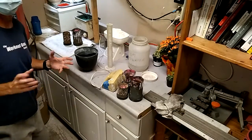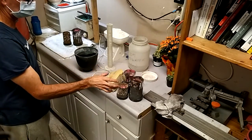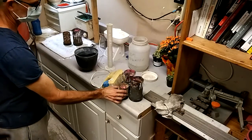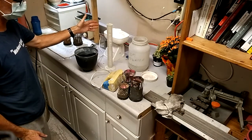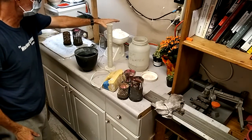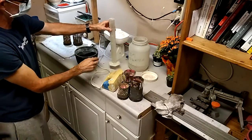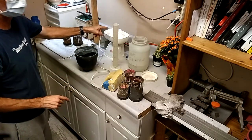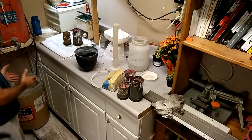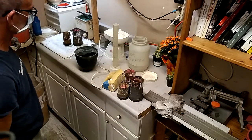I'm going to try and do a video on investing. I have three flasks here with waxes in them. I've got my room temperature water and my investment — it's already mixed. I use 110 milliliters of water for every one pound of investment. I have a big container of investment here; I try to get it in about 100 pounds at a time. The UPS guy hates me.